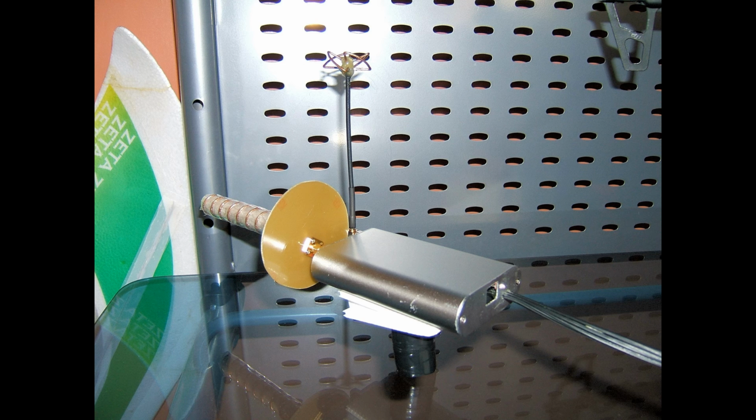My thanks go to Jim for his hard work and dedication to this project, and as you'll see, it works just fine. One port is using a 10-turn helical that I built to the design of Andrew McNeil, who posts very helpful construction videos here on YouTube. And the other port has a Skew Planar attached for omnidirectional reception around the ground station for a range of about 2.8 kilometers. Okay, let's get into some video and show you guys how it really works.